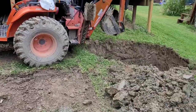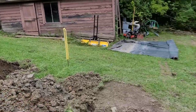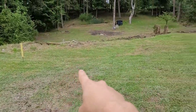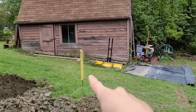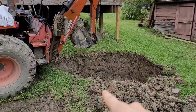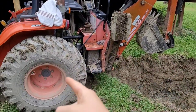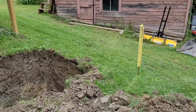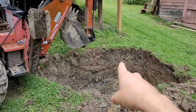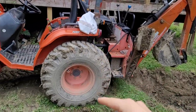We have two 6,000 gallon per hour pumps that are going to be pumped through this wetland style. We're going to have a skimmer on the back side, one on each side of the pond, plumbed all the way around, a 6,000 gallon per hour pump in each skimmer coming through the wetland style filtration and then going to the river. I told you before it was going to cascade down back here. Well, now we're turning it sideways and it's going to cascade out where the tractor is.